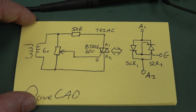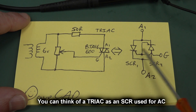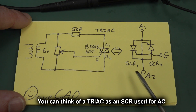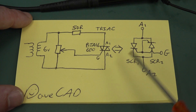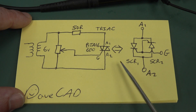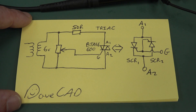If you're wondering what a TRIAC is, this requires a whole separate video because you can really go down the rabbit hole. A TRIAC is basically two SCRs back to back. An SCR is a silicon-controlled rectifier, also known as a thyristor — though technically a thyristor and an SCR aren't exactly the same thing. For most purposes you can say an SCR is a thyristor and vice versa, and you can say a TRIAC is a bi-directional thyristor. The terms for these things are actually rather confusing.